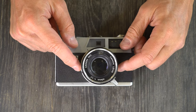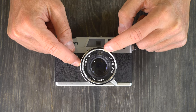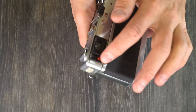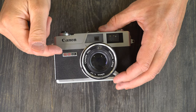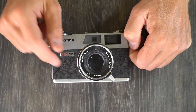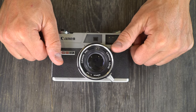This camera does not have a working light meter so it will only shoot in full manual mode. The light meter sensor is on the lens, so filters will be accounted for in metering. It's upgraded from the previous model, the new Canonet, by adding a battery check button. It can also be used in full manual mode without a battery, meaning this rangefinder is not toast if the meter fails. It was made by Canon in Taiwan from 1972 to 1982, and around 1.2 million were sold, so they're a fairly common high-end rangefinder.